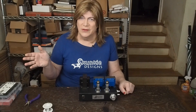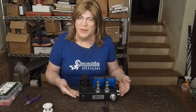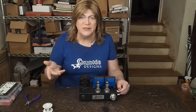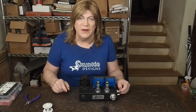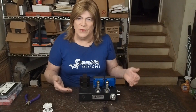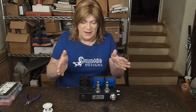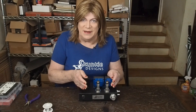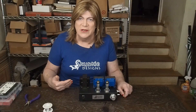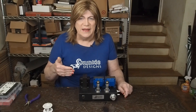Hey y'all! Here to wrap up a couple of projects for the end of the year. One of the things I never did a follow-up on was this little tiny 6BM8 amp I built — one of my first projects on the channel. I've been listening to this thing for months now and it's used in my downstairs system. It really worked out well for what I wanted it for. I'm going to go through some of its strengths and weaknesses. Is this a perfect amp? No. But it's a 5x9 inch chassis, and squeezing a tube amp into a chassis this small and still having decent hi-fi quality — which I think it does, especially at lower output levels — is a challenge. So let's hook this thing up to the Analog Discovery 2 and run the Audio Analyzer Suite on it and see what this little guy puts out.